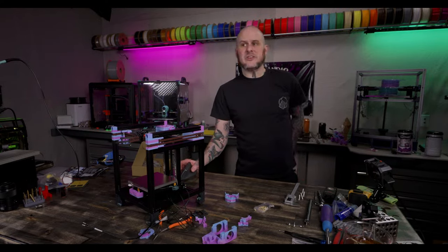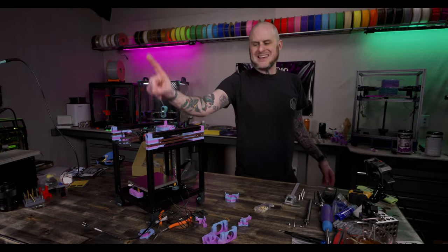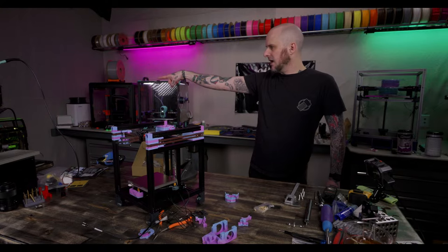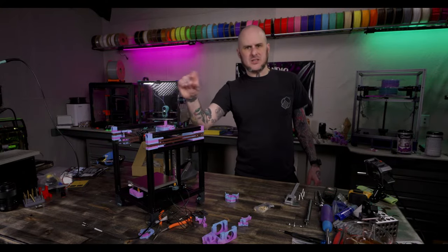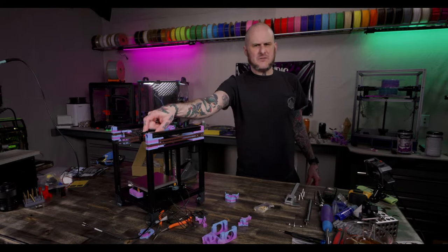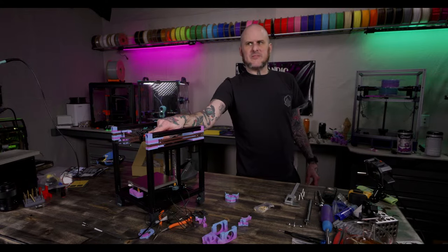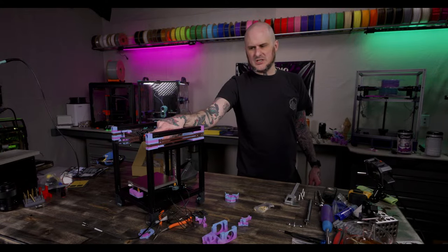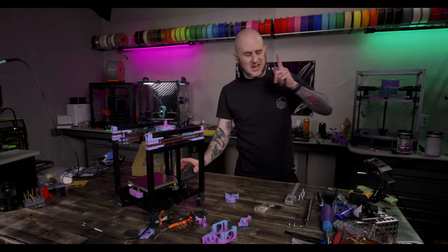Is that carriage the one that needs the M3x4.5s? This one isn't. It's the MGN9 version that needs those. Since this one's an MGN7 carriage, it uses M2.5 screws, I believe, either M2 or M2.5. The MGN9 version uses the M3x4.5. I ordered some.